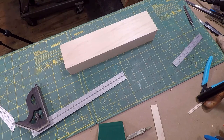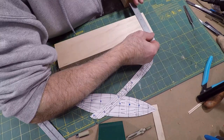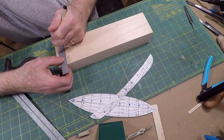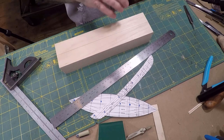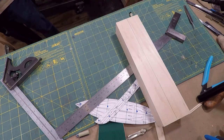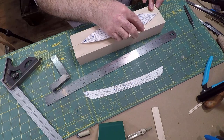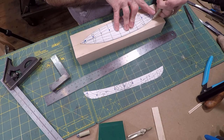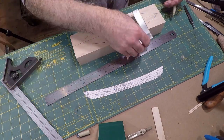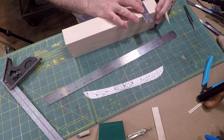Let's make some dust. To turn this block of wood into a whale boat, we need to make two shapes: the profile and the plan view. The way we start that process is by finding the center of the block we're using, which happens to be a 12 by 4 by 2 block of basswood. Once we've got that center line established, we can trace the outline of the plan view along with the station lines. The station lines are important here because they're going to help us register the shape of the profile on the side, so it's very important that we make these accurately.